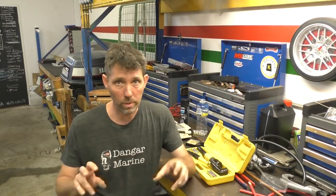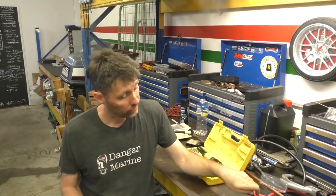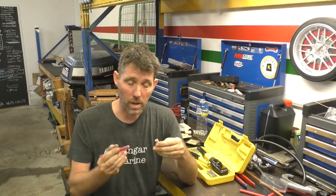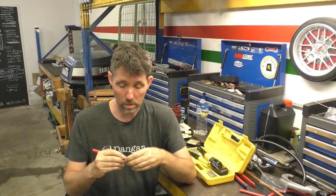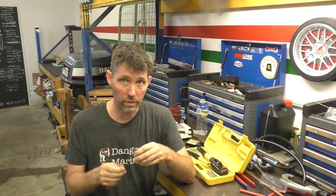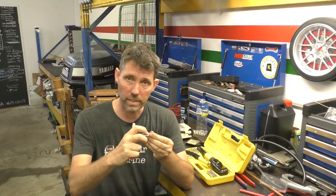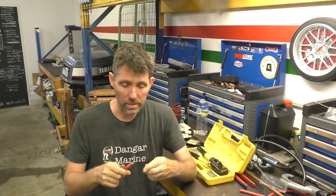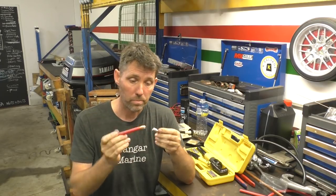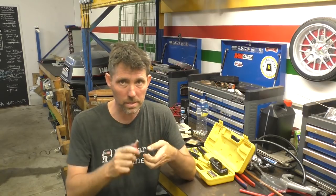I did a little bit of reading into this cold welding idea — the general principle seems to be similar metals. What I don't understand is when you get your commercial lugs that are coated and copper wire, they're not the same metal, so whether they actually cold weld I don't know. One of the points about not having solder on it to start with is that the connection will actually start to get looser if you've crimped it once you've tinned it. So you could put a single crimp closer to the edge and then allow yourself to feed some solder in the front if you'd like to. If you buy pre-tinned wire with individually-tinned strands and put it into a tinned terminal then crimp them — is it actually the tinning that chemically cold welds itself? Someone can hopefully tell me.